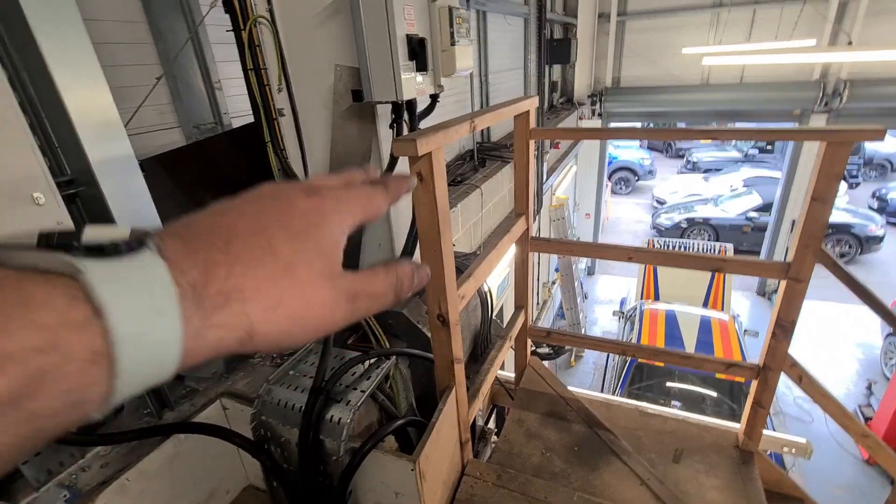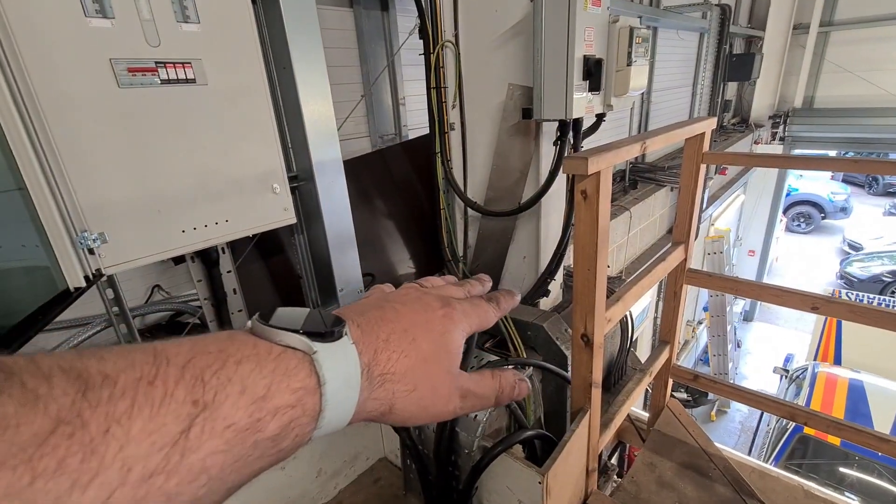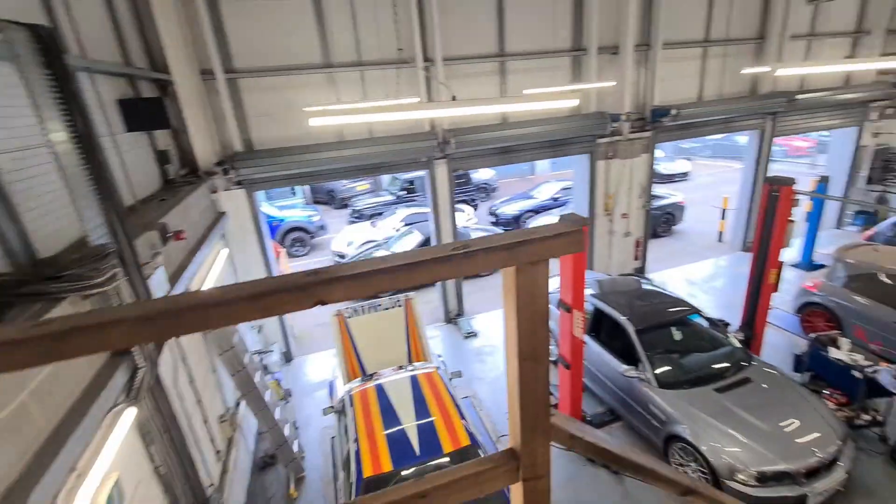I can quickly show you upstairs as well. If we look up here you can see the Hager board - all we've got is the new socket for the security guys and nothing else on this is energized yet, so we've still got a little bit of tidying up here. We need to bring all our cables in, pull them out from that board just down there, drop them into this trunking, dress them away into this board and then neaten everything up. There's loads of steel wire armours to come out and we'll have to extend a few of them as well.